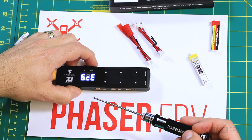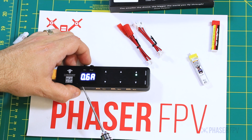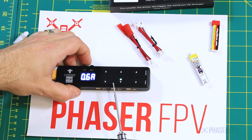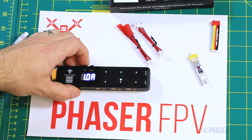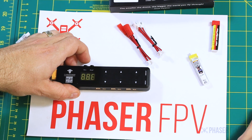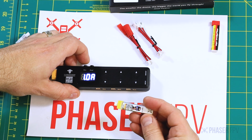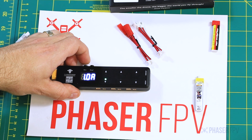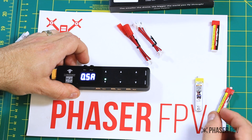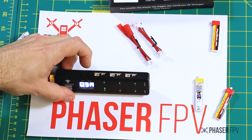You can toggle through and select how many amps you want per port. 0.6 of an amp, or 600 milliamps, is not a sum total — each port will be charging at 600 milliamps. It's adjustable in 100 milliamp steps, all the way down to 100 milliamps or up to 1 amp per port. If you want to stay within 5C charge rates, 1 amp is right on the limit for your 200 milliamp-hour battery. Your 255s are a little closer to around 4C. I tend to operate around 500 milliamps, charging at around 2C for these batteries — they're small, so it's not a really big issue.